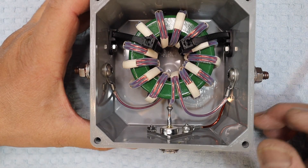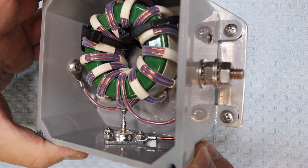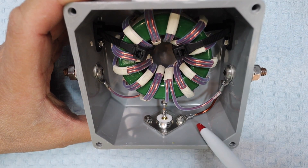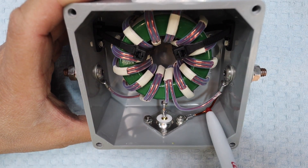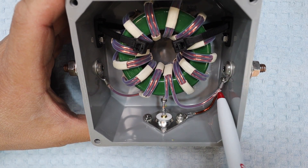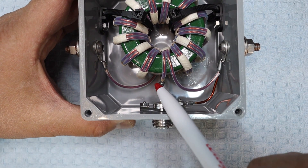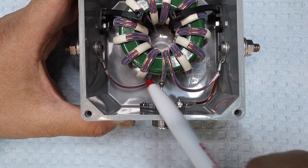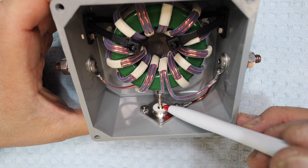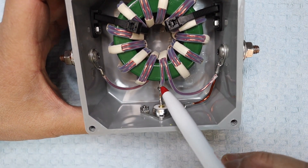Okay, let's examine and take a look inside. Remember, on the left side is the positive side, the right side is the negative side, and here's the feed point for the coax. There's a copper wire from the ground also going to the negative side, and there's a wire also going around the toroid. Looking at the toroid, there are two of them taped together. From the center conductor, it's soldered right here.